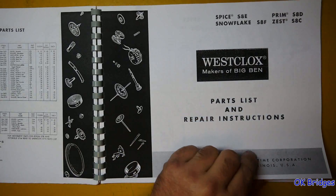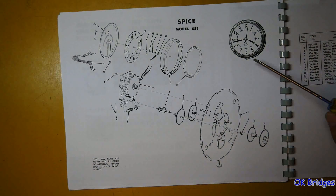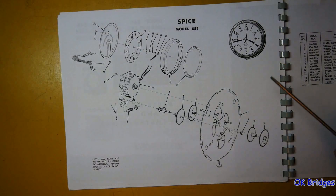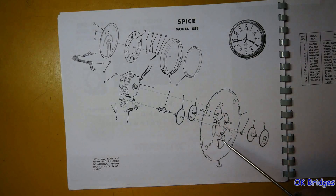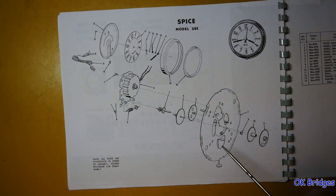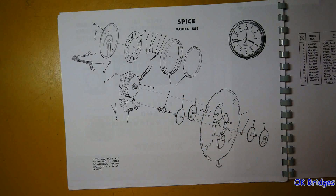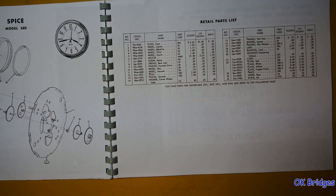Spice, Snowflake, Prim, and Zest — these are a wall clock style case. These use a pendant set where you pull out on the knob to set it. It's worth noting there's a part number for the back plate, which includes the setting crown and pendant — all considered one assembly from a service standpoint. If you have to do repairs nowadays, you'll need to reverse-engineer how that was permanently assembled. They all seem to use the same multi-pole motor assembly with minor variations to work with different movements.